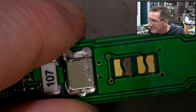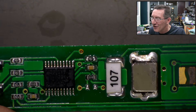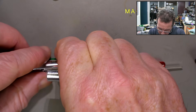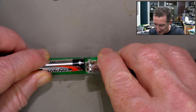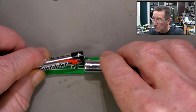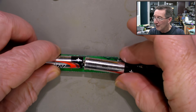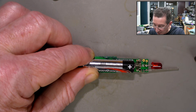I'll just get the isopropyl and get the stiff brush here and give that a good clean. That contact looks terrible too. Like I said, the contact is not the problem. That certainly looks better now. Let's just put the batteries in and have a look — I don't think the chip has failed. Hello — that was a double beep! It's supposed to do the double beep thing. That is the correct business — yeah, it's supposed to flash like that. It's working again!